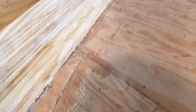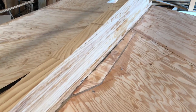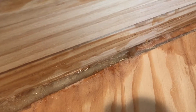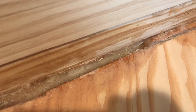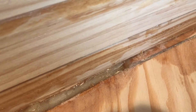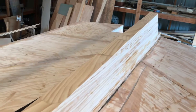After sanding the grooves, they're pretty flat and uniform and ready to accept the epoxy that I'm going to use to create a seam along the hull and the keel — further waterproofing and making her a little tougher. It'll also be a little sturdier if you were to hit something, and since this is the skeg, you can almost guarantee it's going to hit something — it's just a matter of time.